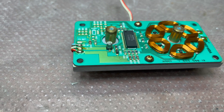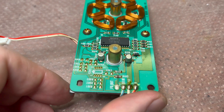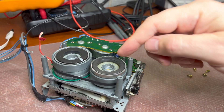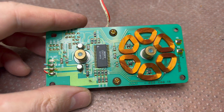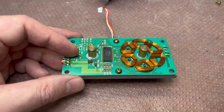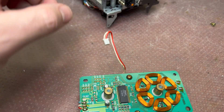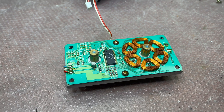Here is what I found: if you look right here, you can see the capacitors started leaking and the pads are starting to deteriorate, so I will be replacing these two capacitors to avoid future surprises. Comparing to the cheaper models, the 555 has both capstans with magnets, and these magnets pull them back. You can see these sapphire bearings — they call them lapis bearings because it's lapis sapphire, mined in Afghanistan. There is a steel plate, and the magnets pull back to the steel plate, so the capstan sits on these sapphire bearings and keeps pace extremely well.